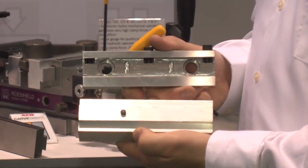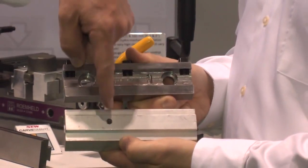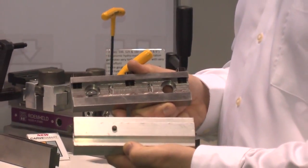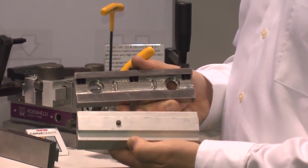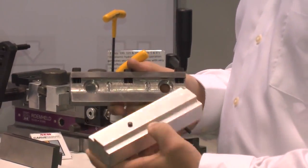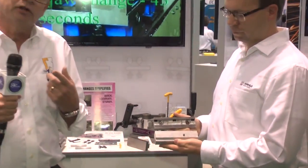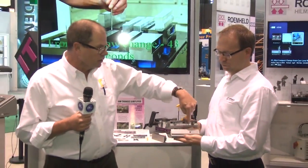This is our Smart Stop relocation feature. It's internal to the jaw system — a simple slot and pin system. Many folks use our jaws once and throw them away; they save the program, not the jaw. That way, anywhere you run it, it's dead nuts to the spindle. In the case that you want to use your jaw again, this will allow you to relocate that jaw in the same master jaw and relocate with plus or minus three ten-thousandths of an inch.